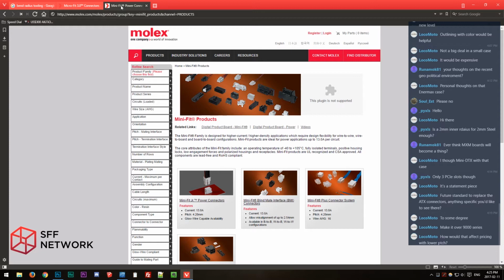If all we did was go from MiniFit to MicroFit, it wouldn't be a huge deal, I guess, because you could just get an adapter. But if we go from 24 pin for the standard motherboard connector to an 8-pin pure 12 volt, that would almost render all current power supplies incompatible. I mean, you could do an adapter off the 24 pin, but that kind of defeats the purpose. Plus, it may not deliver enough 12 volt, since the motherboard would be using pure 12 volt and doing onboard DC-DC conversion for the 5 and 3.3.